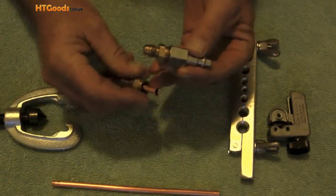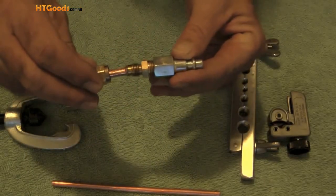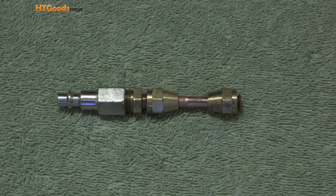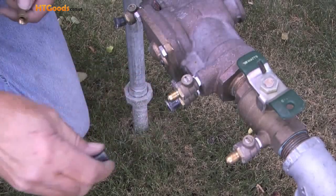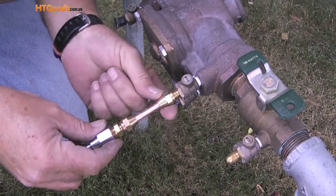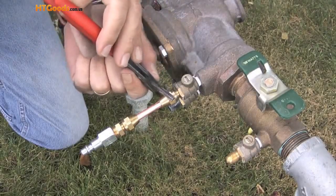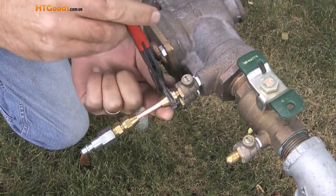So I've made my own coupling with the flaring tool. All I need to do now is thread it onto one end of the union. And this is what the completed fitting looks like. All I need to do now is thread the quarter inch flaring nut onto the flaring end coming out of the test port on the backflow preventer, tighten the fitting up, and I'm ready to blow out the sprinkler system.